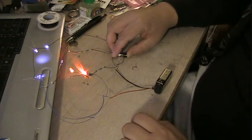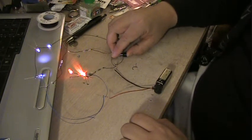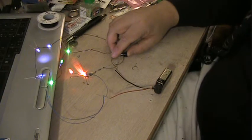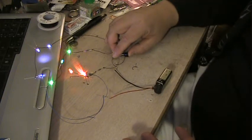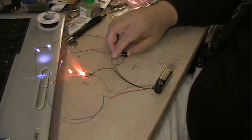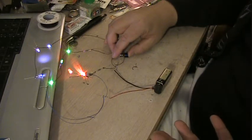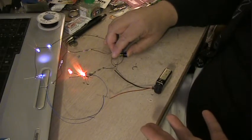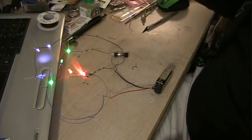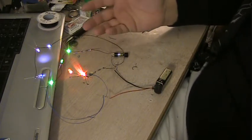As I push the button, the green LEDs go out, but the brightness of the red and white LEDs isn't diminished at all — the current to them remains stable, exactly the same regardless of whether the green LEDs are illuminated or not. I'm not an expert, but my understanding is that it comes at the expense of battery life: the more LEDs you have running, the faster your battery will drain. But the more circuits you have running in parallel, the individual LED brightness will not be affected.